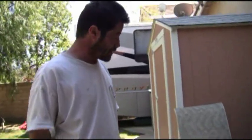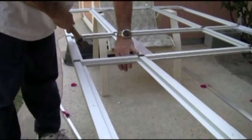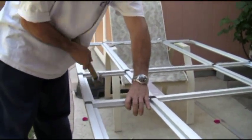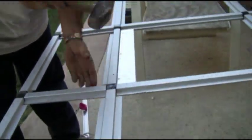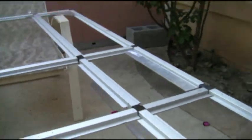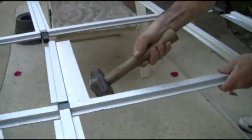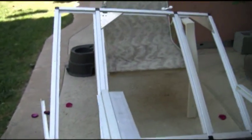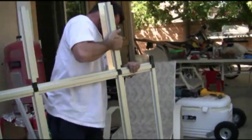Alright, so now we're going to take this thing apart. I've actually kind of machined these plastic things down a little bit so that it's not so tight — so it'll come apart pretty easily. The plastic pieces are inserts, almost like a tongue-and-groove type arrangement. They allow for this aluminum arrangement to be modularly assembled and disassembled. As with all the other stuff we're putting in that light area above the tank, this has to be disassembled to fit through the openings.